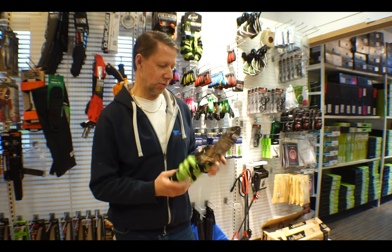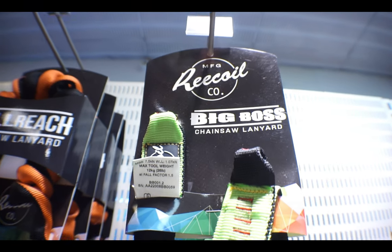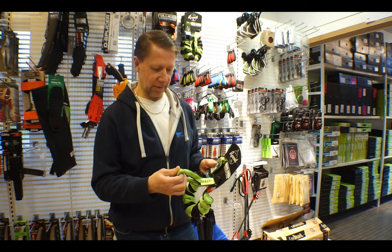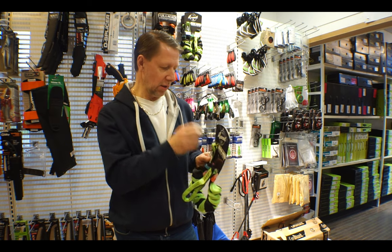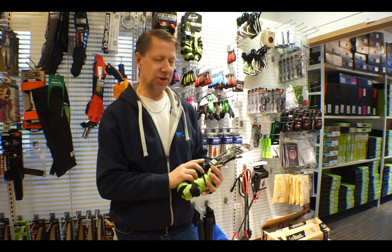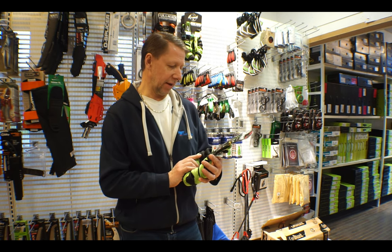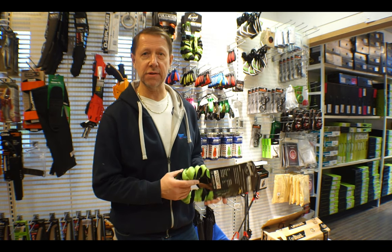The Big Boss has an MBS of 750 kilos and a safe working load of 107 kilos. This is also a non-tearaway chainsaw lanyard. It has a non-choked loop for attachment, still reaches out to 170 centimeters but coils down to about 40, so it sits very tight on your harness. It takes a max tool weight of 12 kilos.